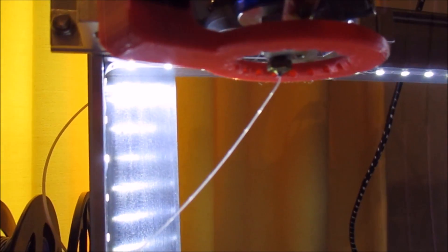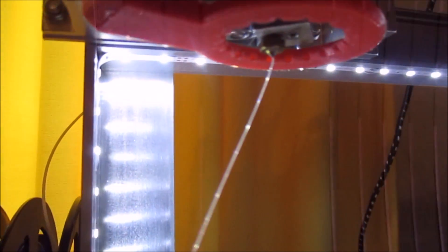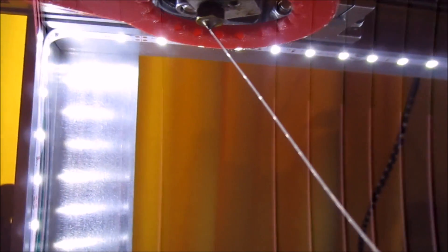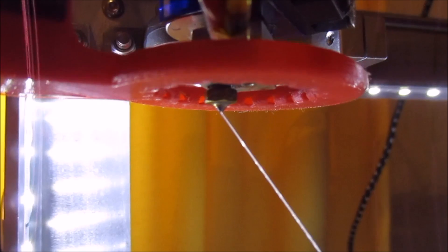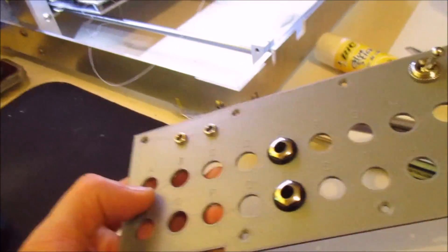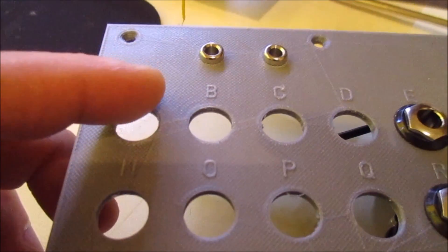You can hear it slipping a little bit because I'm pushing through so much so quickly. Even after the extruder stops you still get a little bit of filament coming out, so I'm going to let that finish dribbling and then restart the print. It should continue from where it left off and finish the top few layers of the lettering in white filament.